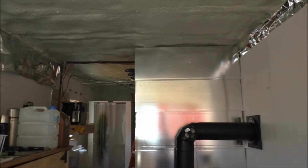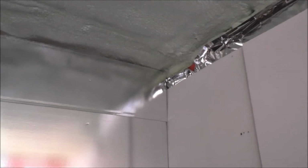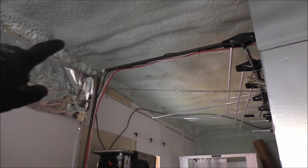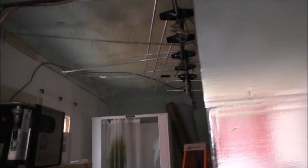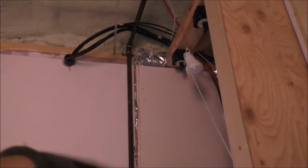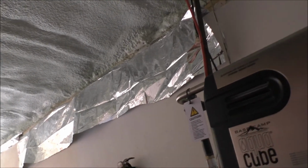Oh, another thing I gotta point out. Since I put the solar closet up here and backboard for the fireplace, this section goes past the wall, whereas this one ends at the divider wall. So I basically have to start here and make sure I put the 2x4 at the same place, same measurement as this, or things are gonna get screwed up. Because I continued back beyond the next seam like this one, and that's not gonna happen. So I'll have to hide that eventually another time.